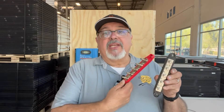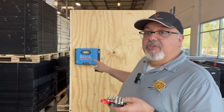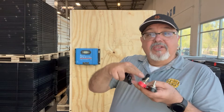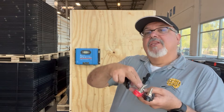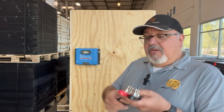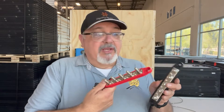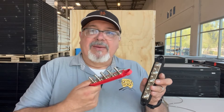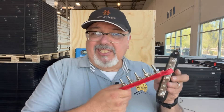I'm going to be using bus bars. Using bus bars makes it a lot easier for connecting devices — that way you don't always have to unscrew them from the terminals. You can put them directly here and other devices can attach to this, making it much easier to move. Bus bars let you hook up multiple devices without stacking connections one on top of the other, so it's a little cleaner and a little safer.